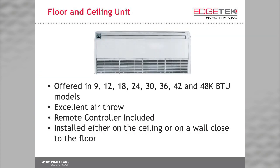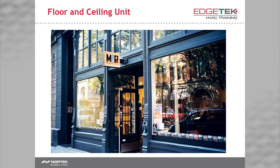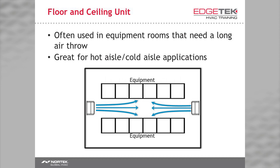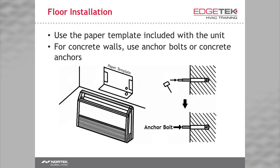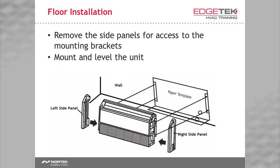Let's install a floor and ceiling unit. It is a fairly large unit physically, but it can be installed on the ceiling or wall. You'll often see this type of unit above a door on the ceiling in a storefront in lieu of an air curtain. Another common installation is in equipment rooms where your customer would rather not risk having a water-producing unit above their sensitive electronic equipment. The big selling point of this style is its superior air throw. In a wall mount installation, you'll need roughly two feet on each side for service. Mounting this to a wall is a lot like the console, but the mounting bracket is built into the unit. Use the template to mark your holes — if your template is level, your unit will be level. You'll need to remove the side panels. To do this, first access two screws behind the return grille. There are tabs across the return grille that you slide to lower the grille, but there are screws behind these tabs — pop the tabs off and remove those screws.